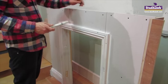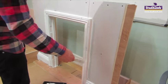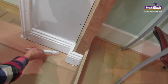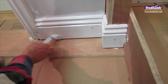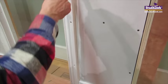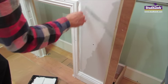When you finish painting, you don't want to just stop. What you have to do is go back around every area where you've been, after say 15-20 minutes, and look for the runs. Just make sure you brush out any runs. We are going to sand this, but we don't want to be sanding through any paint runs. It's only the primer coat — the first coat — just check we've brushed out nicely and it's not too thin.